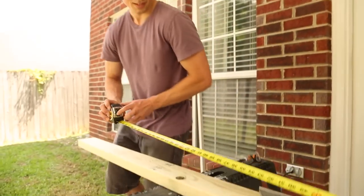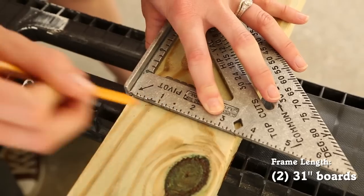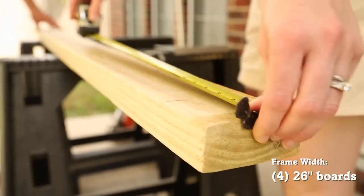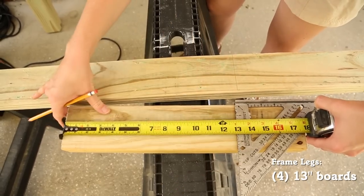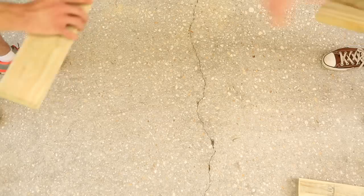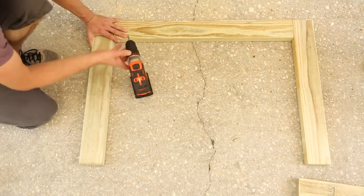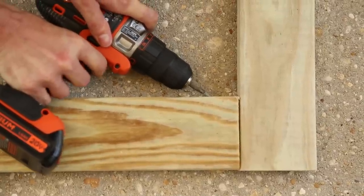After agreeing on the plan, we're ready to make some cuts — a lot of cuts. We start off with the length and width of the storage frame, then cut out the legs, or vertical pieces, for the frame. We're using our speed squares and a circular saw to keep our cuts perfectly straight. Next, we lay out our top and bottom frames, leaving one side open, giving it a U-shape, to make it easier to store things once it's all put together. Attaching two boards together with a screw like this is called toe nailing — a technique useful when you're only able to connect boards at an angle.